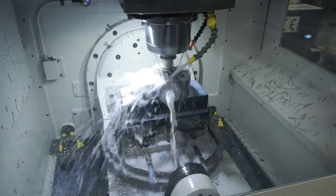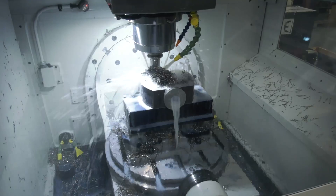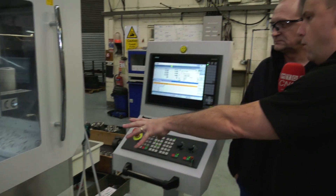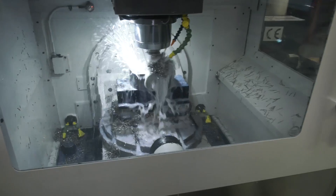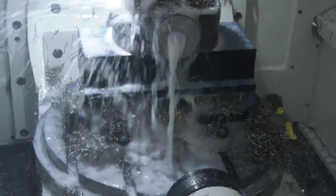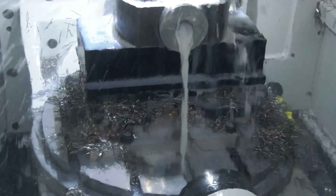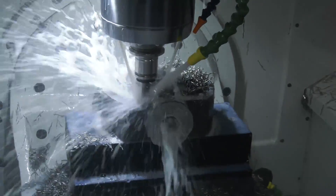What sort of surface finish and tolerances are you achieving with this interpolation? Within 0.2. You've almost got two diameters in here — actually three, because there's a middle one as well. Talk me through the work holding — you've got the zero point system, what's the advantage? Every fixture we put on there will have one datum, and the probe comes in to double-check and verify the bores are the right size, rather than machining a part and ruining it on the first stop. We've had no movement yet with the clamping forces.